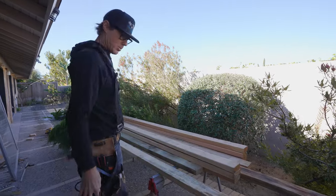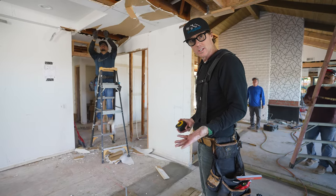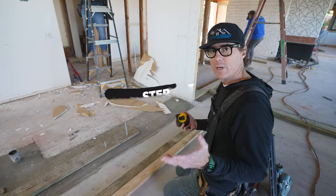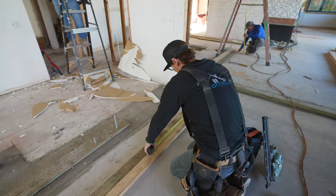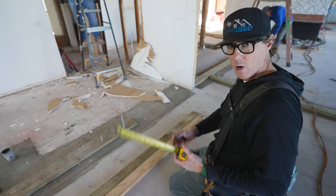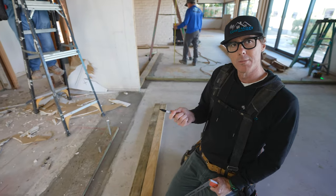We've got our plates cut. The objective is to lay out and identify where our studs or wall framing will go. The wall has one opening — a pocket door. The first thing I do when laying out walls is lay out my openings first. Coming off the wall about 13 inches is going to be the start of our door opening. The plans tell us it's a 58-inch rough opening — rough opening means stud to stud in the clear. Door openings require a minimum of one trimmer underneath them, so we have a king stud and a trimmer.